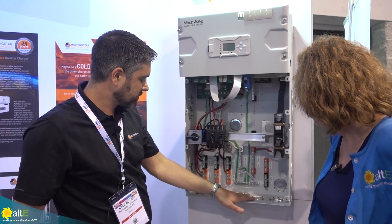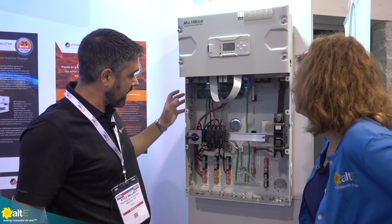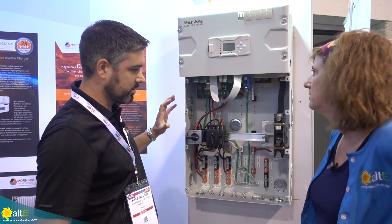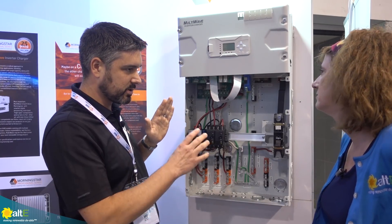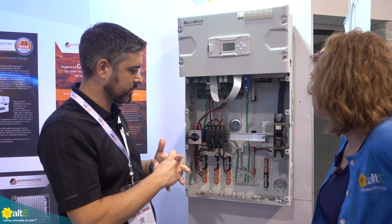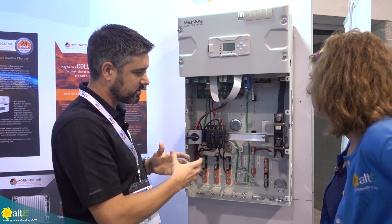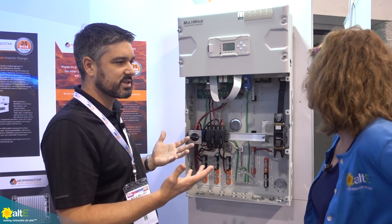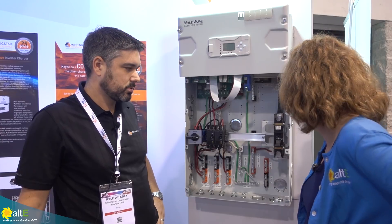Batteries go on the side. You're talking about a couple of connections, maybe some Ethernet connections to this four-port Ethernet switch. On the sides there are four plates — optional mounting locations for your TriStar charge controllers. They can be mounted in either position; the hole locations match with the edge of the side of the TriStar, so the routing of the wiring is as seamless and clean as we could make it. You could in theory add up to four, but we've given you the space in this configuration for balance of system for up to two. If you can accommodate additional breakers, there's really no limitation to how much solar you can add — it's nice to have the flexibility to put it where it works for your particular system.